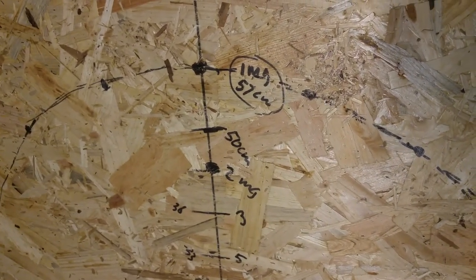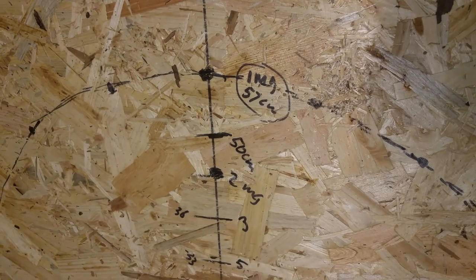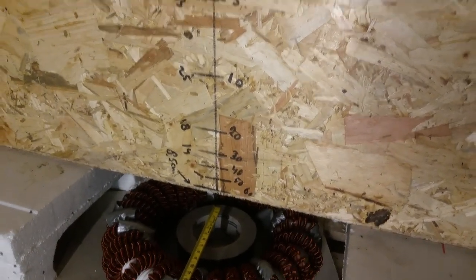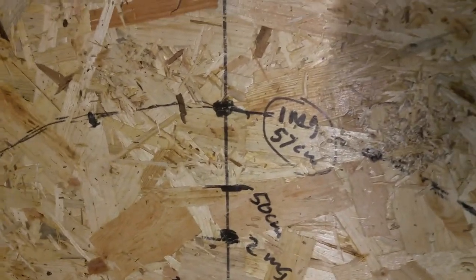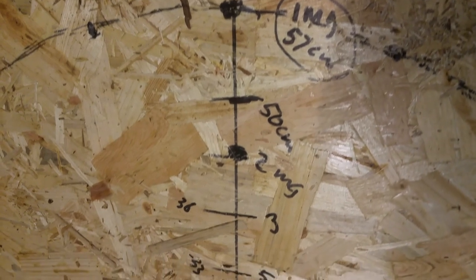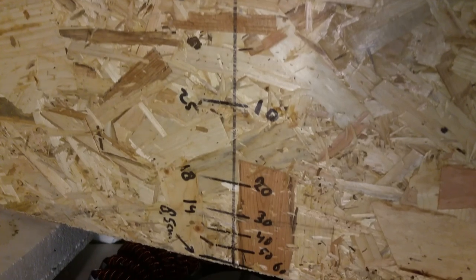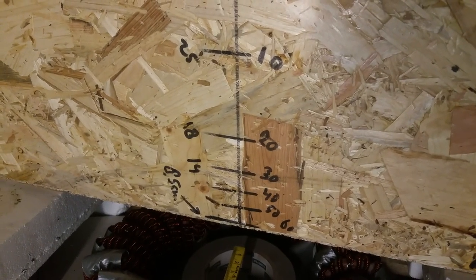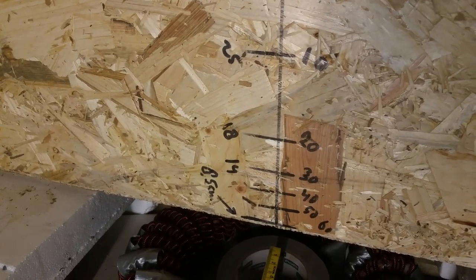So the field is not a full circle — it's a little bit more pinched in the middle, which is what you would expect. But on the other end you would expect more. This is one milligauss, two, three, five, ten — to sixty. On the edge of the board it's 5.8 centimeters from the center.